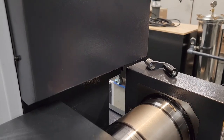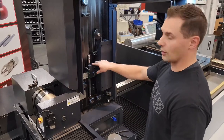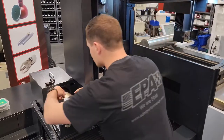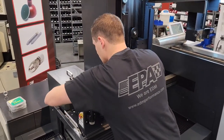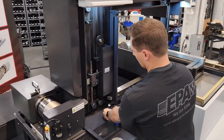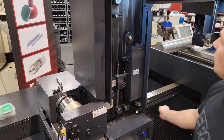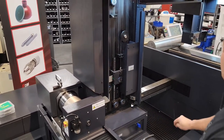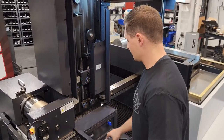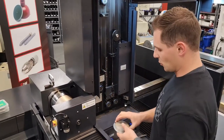Now we're ready to unhook and unscrew the wire. Now that we're on this side of the machine, we're going to first lock our tensioner out so it'll get us out of tension on the wire. I'm going to unhook the wire from the drum and cut it loose down here. Then I can pull my old piece out of the machine. Once that's off, I can lock the tensioner all the way down and put my unspooler on.